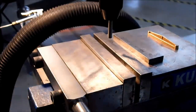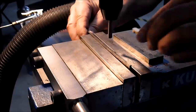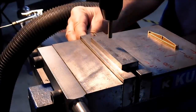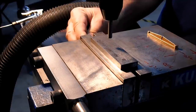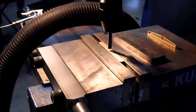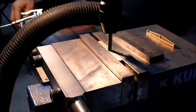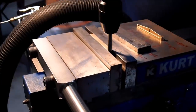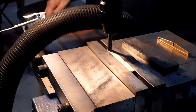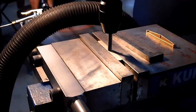I'm going to show you a little trick on how to set that up. Lower the part down into the vise, gently lift against the existing parallel, close the vise — we are right where we need to be. Put a pin in the drill chuck just above the part, find the end of your part so it visually looks lined up, zero it out. Do the exact same thing to the other side, record the number, split the difference — that is now the center of your part.